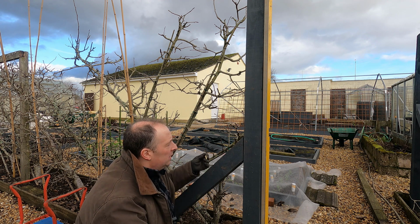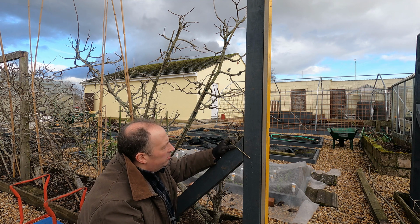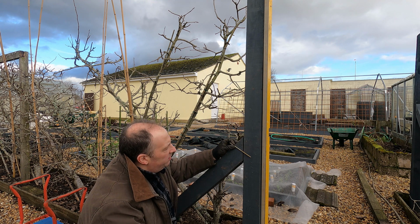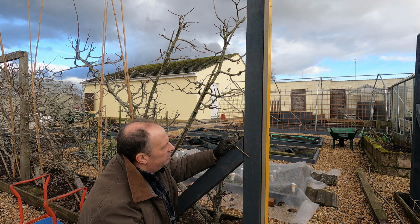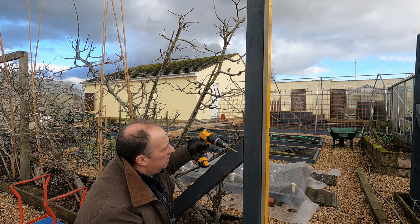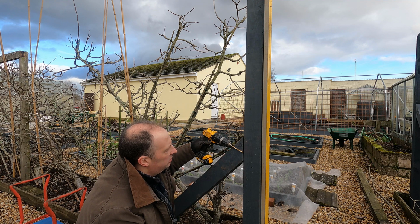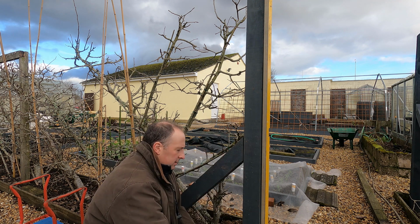so long as it's solid. Now I've got some 150mm screws here, which I will put in at an angle, something like that. And that will definitely hold this straining post in place. I'll put 2 in each post. I will be putting through a large size clearance drill, and that's important so that I can pull this post up tight.